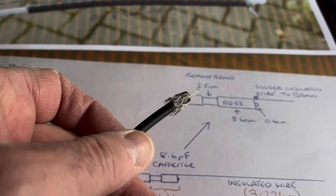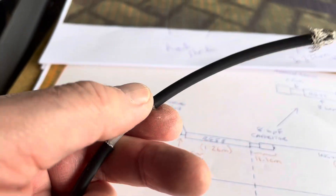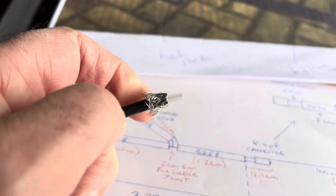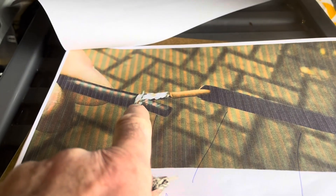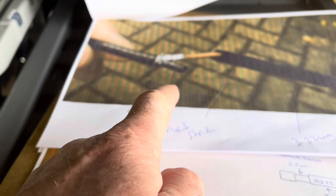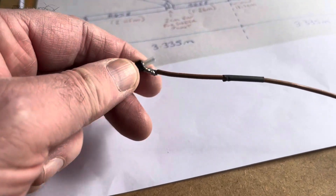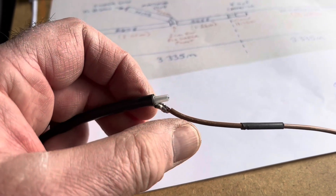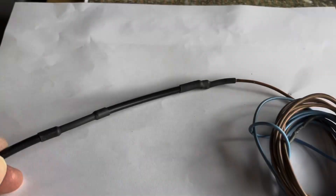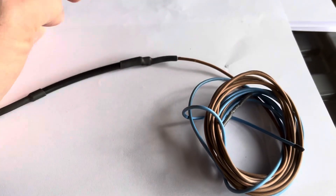So this is the start. Jacket off. Now I need to take the braid off without damaging the centre insulator. Bared off — it comes off really easily. Just be careful with your side cutters, nip the braid and tidy that up. Need a bit of heat shrink on that, then tin up this braid into a little tab. That's the single flex we cut earlier. A bit of heat shrink on that tip just to protect it, solder that together, heat shrink it up — and that's all the top end of the antenna complete. The gap is all sealed up, as is that joint. The top element is now attached to the braid.